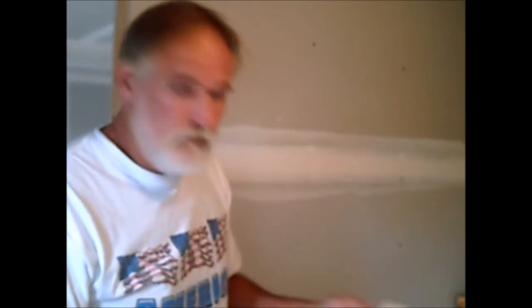So we don't need to put on any thick, heavy, deep layer of mud there either. What we want to do is put our tape in the corners. Again, a uniform layer of mud. Put our tape on that, wipe it down firmly. We want to get as much mud out from under the tape as we can. We only need enough mud under the paper to actually stick it to the drywall, so it doesn't take a lot. And we want the tape as close to the surface as we can so that it's easy to finish. And it takes very little work or effort. And actually, it doesn't take a lot of talent either if you do drywall properly. We'll take a look at that here in a minute.